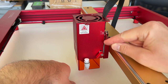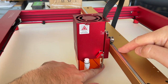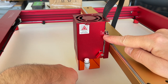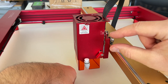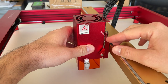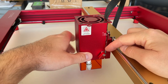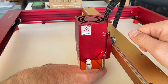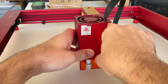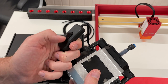Right now this piece is at zero, so when you put it down the focus of the laser will be at the tip of this piece. But if you'd like to put the focus inside your material — for example when cutting very thick material — you can adjust it with this lever. So if you set it to three, and touch your material with this piece, the focus will be three millimeters inside your material. Let's put this back at zero. This is the air assist pump — it's very simple, with only one on/off button.